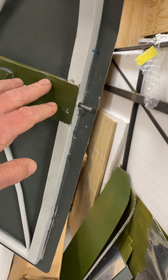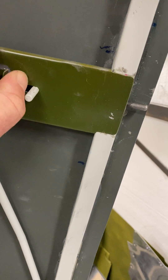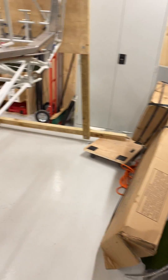I took all the paint off before bonding, then degreased and cleaned thoroughly. There's a little grab latch here that's bonded in place too — in my mind that's a bit of a canary in the coal mine. It'll undergo a lot of use, and if anything is going to let go I think that will go first. It does appear to be very strong. You can just see the adhesive there. The product is Scotch-Weld DP 190 and it takes seven days to cure.